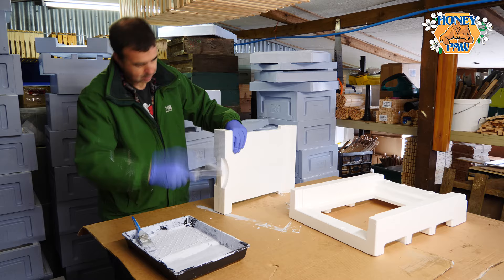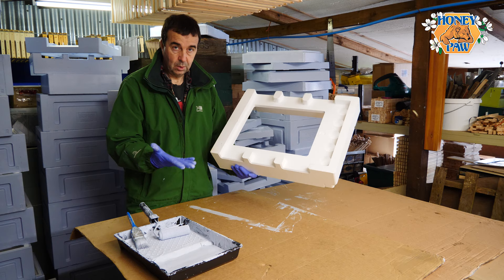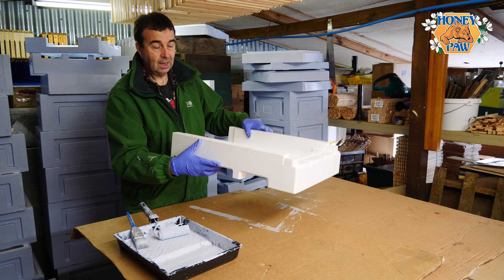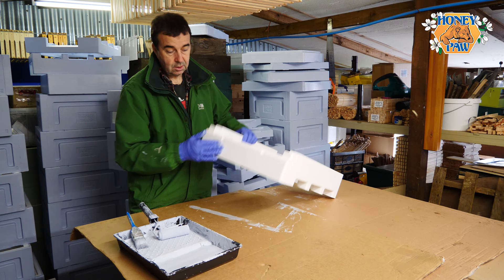That's done. Probably the most awkward part of all the painting are the floors because we've got lots of little areas. This is the underside — although it's not exposed to the sun, I do like to paint it to give it a protective coating because it's going to be sat out in the elements and exposed to the damp. It's all the outside faces we need to paint; we don't need to paint the inside.